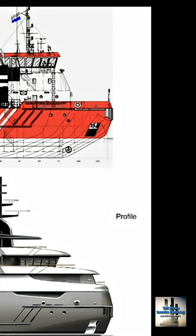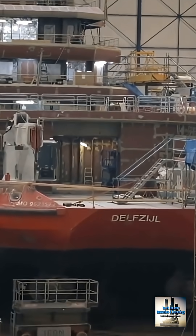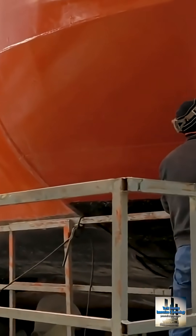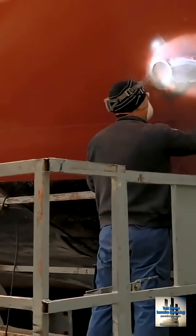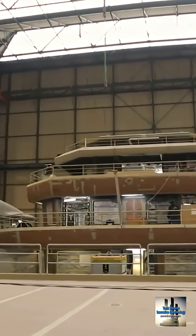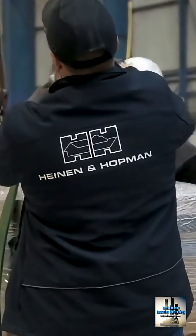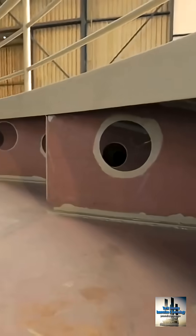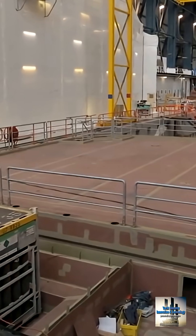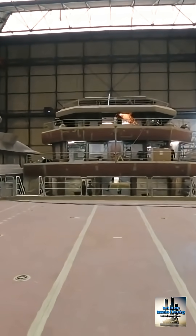That's a very big decision in doing a conversion because you have to overcome the fact that it's starting with a profile that's not great compared to a beautiful yacht, and you've got to deal with that profile. Keeping the pilot house and existing works is a smart thing to do because moving it is very expensive and adds nothing to the vessel's capabilities. So they designed around the existing forward pilot house to make quite a good-looking and meaningful profile, while keeping its seaworthiness, ballast, and weight proportions correct.